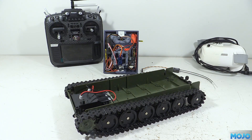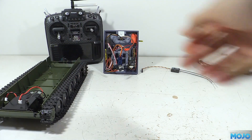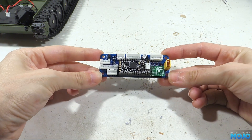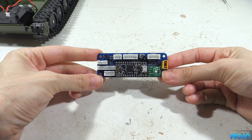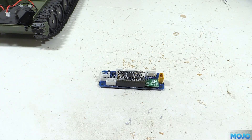Initially my thought was to make something that takes the S-Bus as an input, then uses the channels to control some lights and the gimbal and the motors. But that didn't last long. What I ended up with was this little guy — it's a logic board for a modular system. It has the power supply, microcontroller and connectors for various modules. The idea being you just connect what you need for the model. So it's not just for the E1 anymore — it should also be able to run Tamiya trucks and many others too.